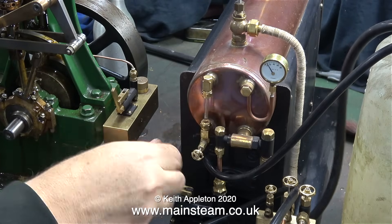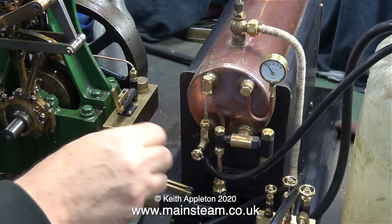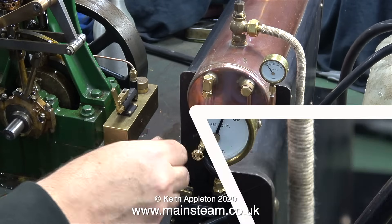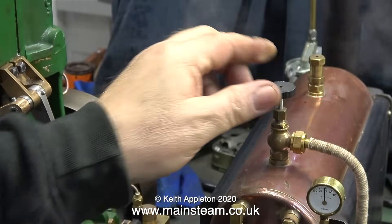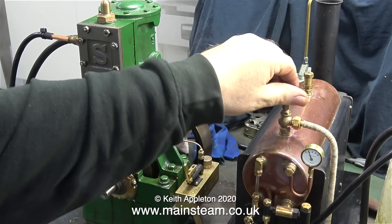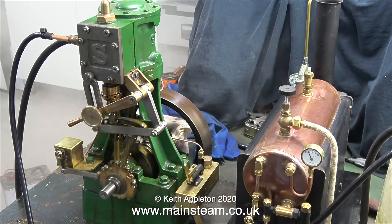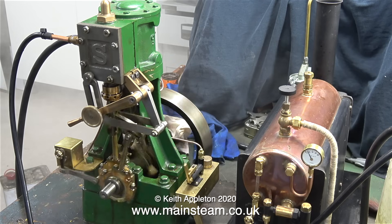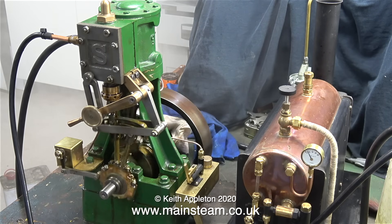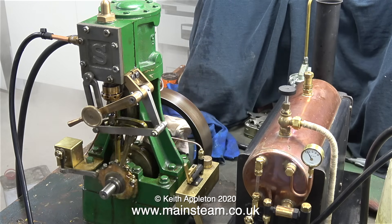The 5A steam engine with its 2¼ inch bore cylinder will only run with the steam from this boiler for a very short time. Here I'm pumping some more water in. I shut off the engine and let the pressure build until the safety valve blew, but almost straight away the pressure in the boiler dropped. The engine is making a really horrible knocking noise. The timing on this 5A is slightly retarded, but normally it runs very well. Valve timing is very important with regard to a steam engine, as it is with an internal combustion engine.